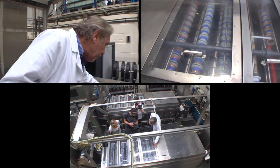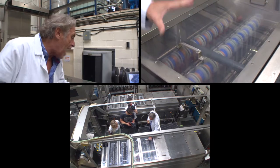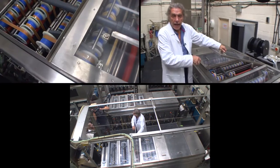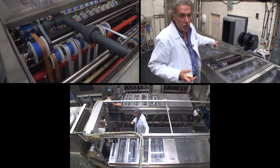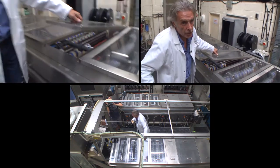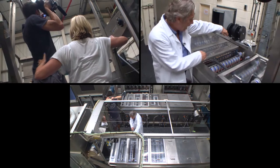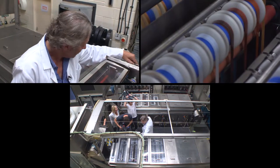There's not much of an apparent image at this stage going into the bleach. Once in the bleach, the film is no longer sensitive to light, even though at the moment it doesn't look like a traditional transparent negative — it will do when it gets into the fix. It comes from the bleach into the wash, backwards and forwards from one solution to the next. Between all the solutions there are wiper blades, which take off the excess fluid to minimise and stop any carryover and contamination. Then it goes into the fix — you can actually see the film changing into an apparent image while it's in the fix. It comes in as an overall orangey colour, and if you hold it up to the light, you'll see the image recorded in the camera.